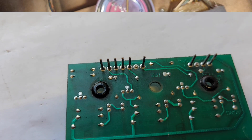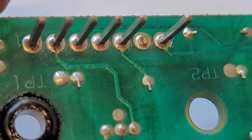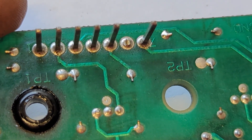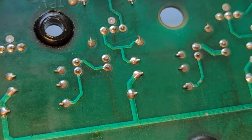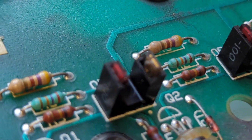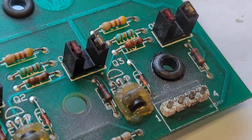I've got this over on the bench and good news — got some seriously cold solder joints. That one on the right there, see how it's broken free? That's good — maybe that's the whole problem. So I'm gonna clean these with alcohol and a toothbrush and reflow the solder on those header pins, in addition to all 12 of the optos, and clean the opto windows. You see those windows are just filthy. Alcohol and a q-tip — I'm hopeful this thing will work.